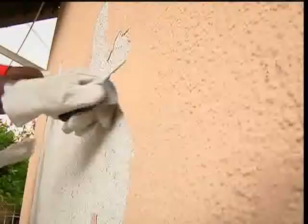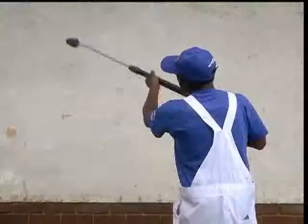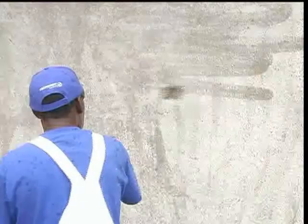The first thing we have to do is remove the old worn out paint. Now because of the multiple layers, I suggest we remove it with a paint scraper — it should just come off. After the scraping is done, we'll use a high pressure hose with a rotating nozzle. That will take care of all the remaining paint but also the contamination, and will do very little damage to the plaster of your wall.